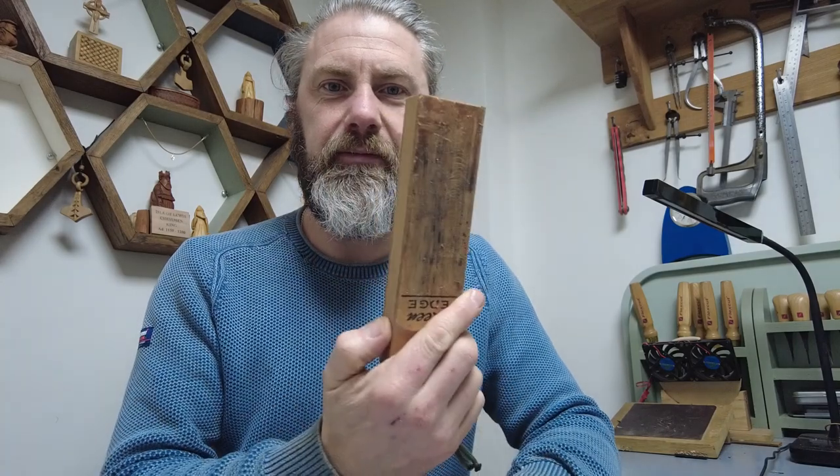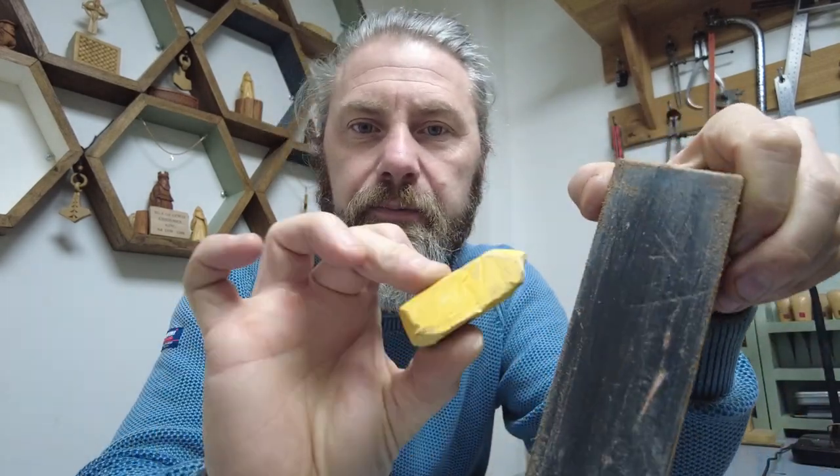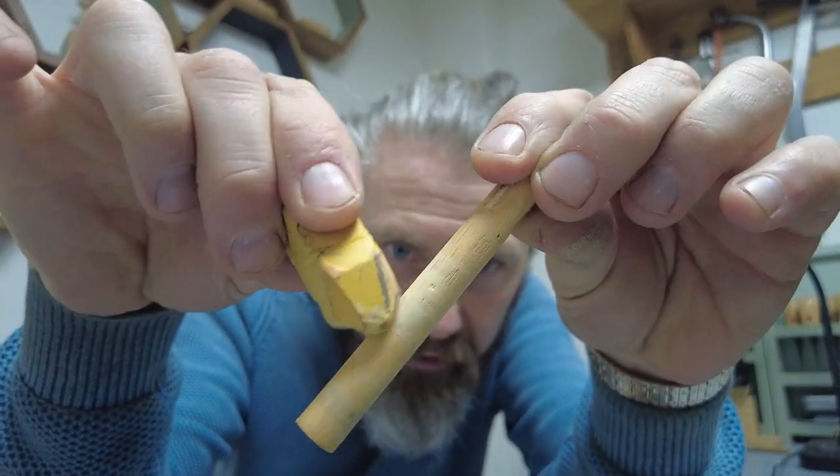What tools do I use? Pretty straightforward — standard stropping. This one's got a suede leather side which you load up with your compound, and on the other side is the smooth leather, which is called Keen Edge. It does make a little bit of difference at the end. That does the outside of the knife, and then for the inside of the curve you can get a small burr — I use a piece of dowel, stick it in a drill, and run the soap up and down to get a little bit of grit on the wood.